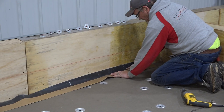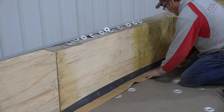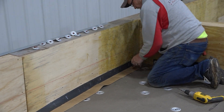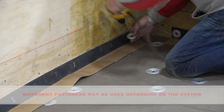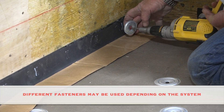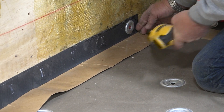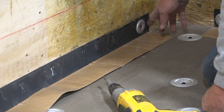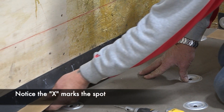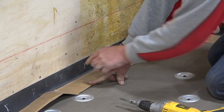You don't want your paper to come up onto the wall — otherwise it's hard to pull the paper off. What I'm going to do first is set my first screw. That plate, you don't want it any further than two inches from the very edge of your cutoff end. As you can see, there are white X's in the perimeter strip, and those X's are every six inches.